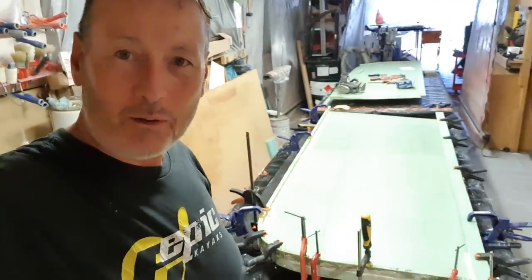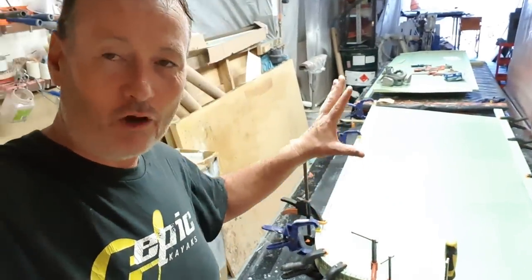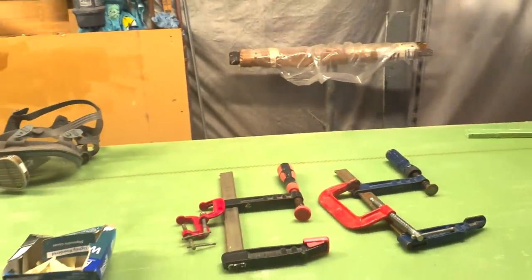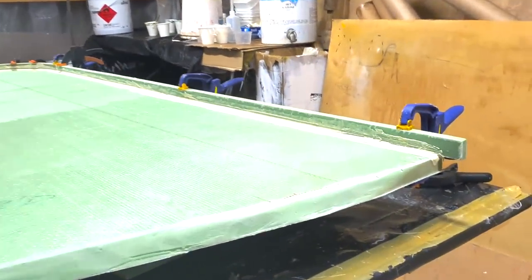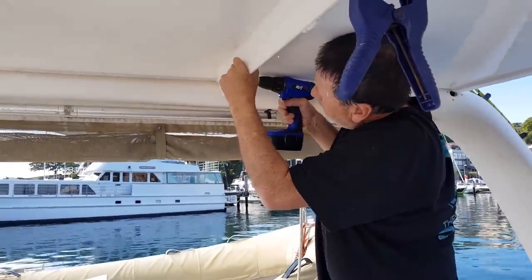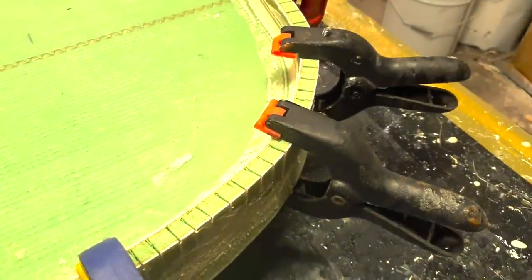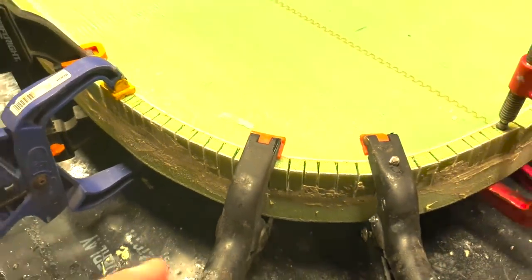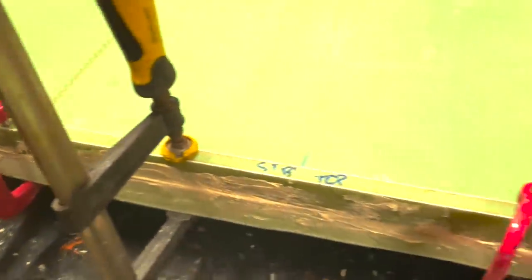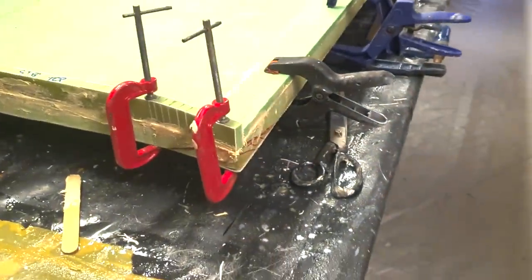This has been a pretty big project so far. I'm three days into it after laminating and in three days we've basically got the basis of both Targa infills. We've run out of clamps so we're going to do the other one first thing in the morning, and by tomorrow afternoon we'll be able to act on this edge. That's the underside of the inside and that'll allow us to through-bolt this into Ron's existing solid glass Targa with no problems at all. In the morning once the glue has set, I'm going to make sure these are filled with resin and foam bedding compound so there's no chance of any air bubbles - on a hot day you might get expansion and could end up with some delamination.